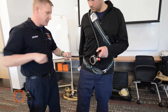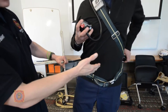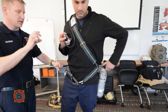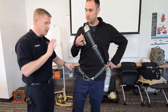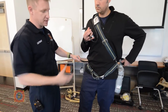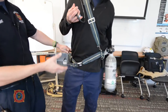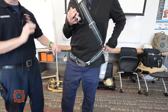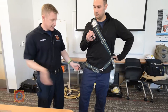Before I put him on the umbilical, I want him to do a bump test. I would explain and demo: turn it on, make sure he's got air, he can crack the purge valve. He knows his harness and his bottle are good. He's looked at the regulator and the gauge. He knows he's got air in it and that it's working properly. Now I put him on the umbilical — he's done that bump test first and he's aware that air is coming from the bottle.